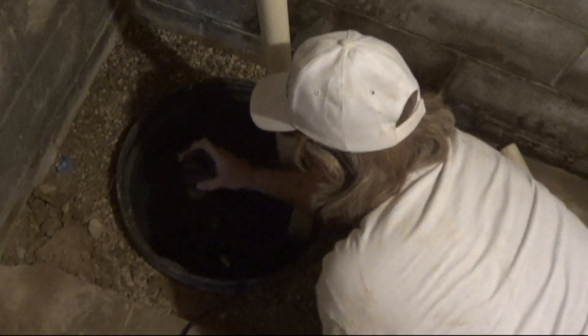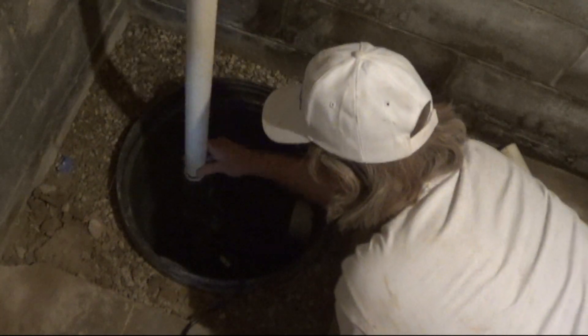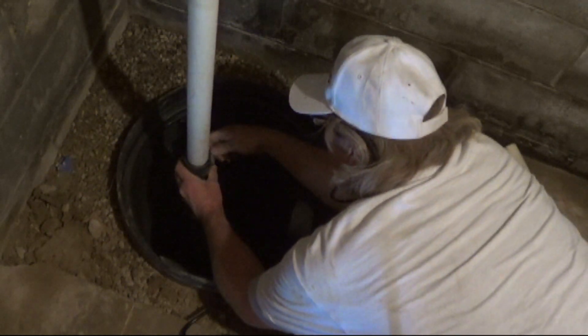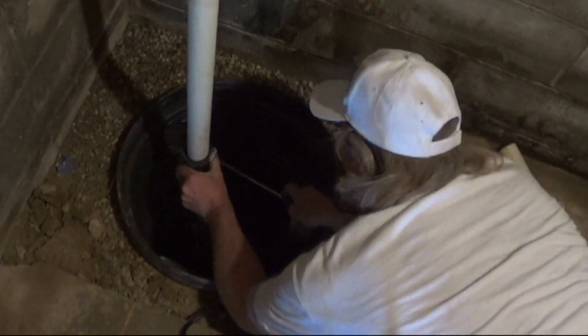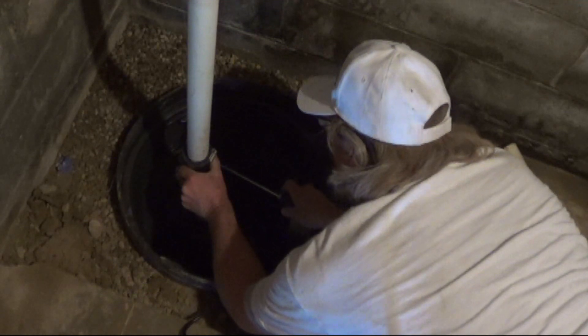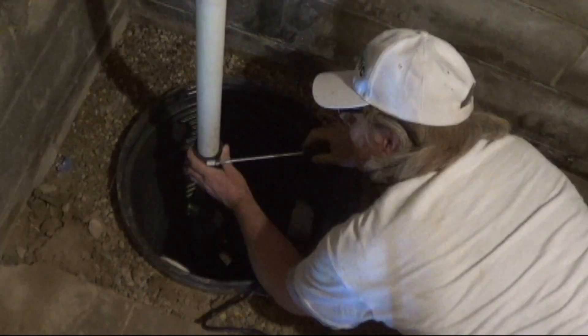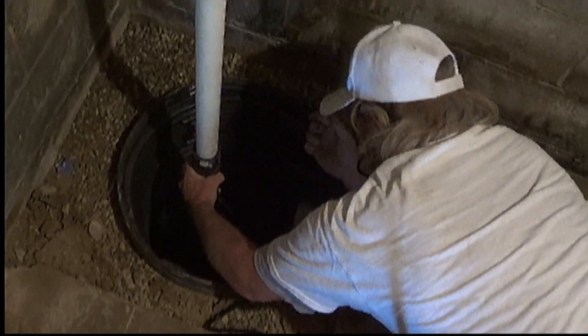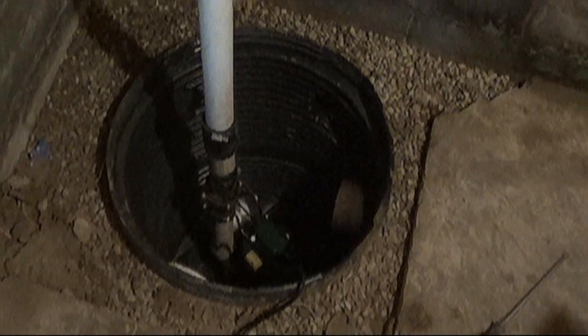You have an option of installing an inch and a half PVC coupling or an inch and a half rubber boot or no-hub. That's what we're using here for quick disconnect as well as quick installation. Be sure you tighten down those clamps good and tight — no water will escape from there whatsoever.